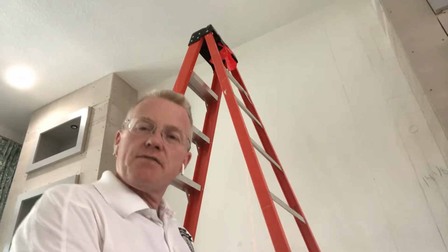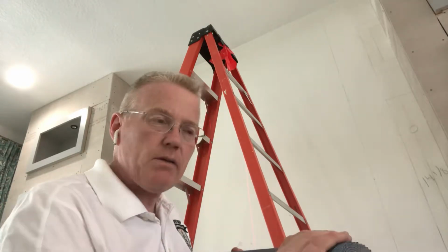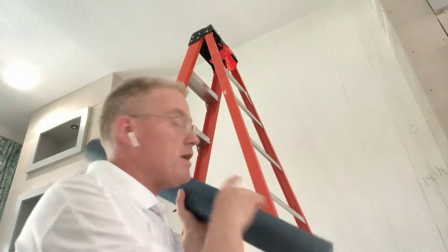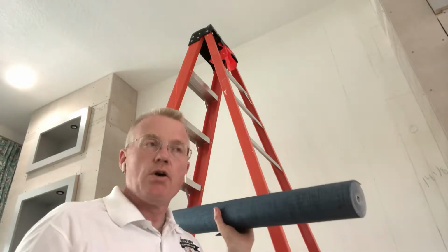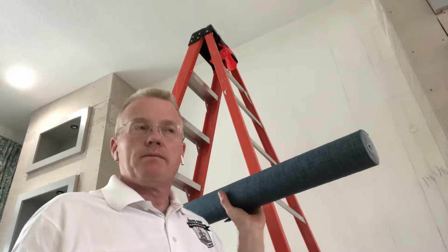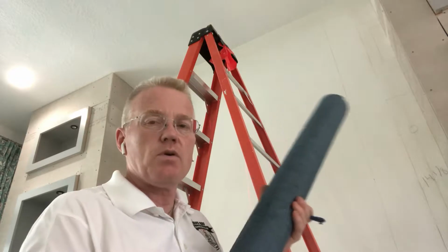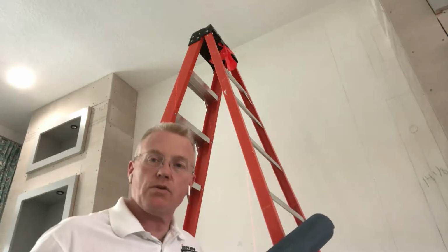So you understand the difference between starting in the middle and then starting the planning from the middle? We're going to start the plan from the middle. In that, the middle of the first sheet will be in the direct center of this feature wall. It has to do with symmetry. When you look at grass cloth or any feature wall, the center sheet should be centered in the center of the feature wall. It's not the case when you're laying out a whole room installation or 2 walls.